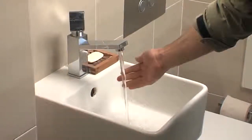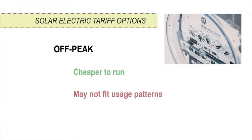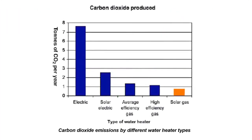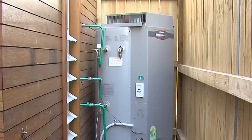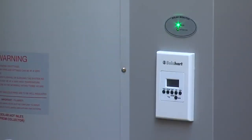When advising the householder on their energy tariff options, explain the pros and cons of each option. A regular tariff allows boosting at any time, but it won't lead to a reduction in their bills if their previous system was electric off-peak. Off-peak will be cheaper but may not fit the hot water usage patterns of all households. If available, extended off-peak or off-peak two is often a good compromise. Natural gas boosters have the advantage of lower emissions and running costs compared to electric boosters and also aren't subject to time of use restrictions. Install a timer on gas storage boosters to ensure the gas does not heat water which would otherwise be heated by the sun.